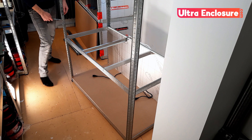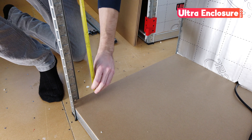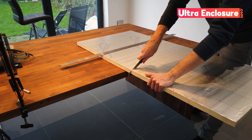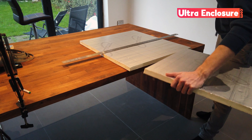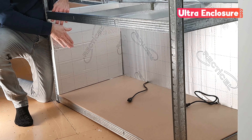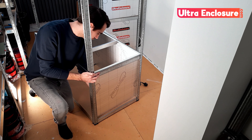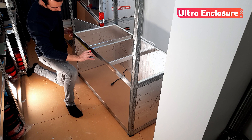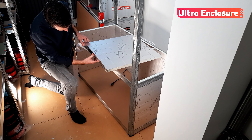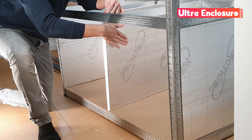Next we need to measure the opening for the side panel — once again all the way into the corner and right up against the initial foam board. Double check the height, it should be the same as the backboard. Cut a piece of foam with these dimensions and fit it. Start at the back and slide the front edge into place. If you have a nice tight fit you can cut two more identical pieces. Insert the second piece on the other side of the shelf. Finally measure and mark the center point of the shelf. Apply foil tape to the front edge of your last piece of foam and slide it into place centered on the marks we just made.